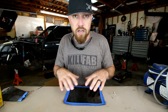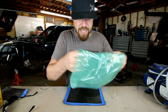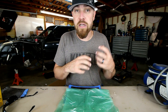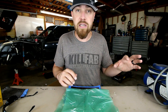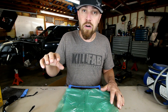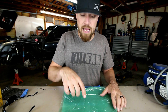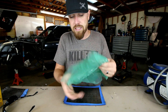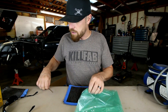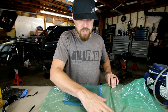To recap: you've got the mold, the wax, the PVA, outlined with the gooey stuff, four layers of wet carbon fiber. Now it's time to stack the vacuum bag material. The first layer that goes on top of the carbon fiber is called peel ply or release film. Your peel plies are more fabric-based and your release films are more plastic-based. You'll want the release films with holes in them because you want the resin to be able to drain through. It doesn't stick to the resin and it's easy to pull off.